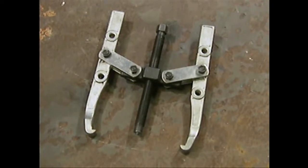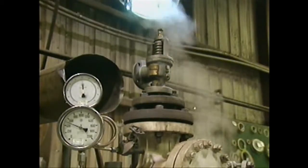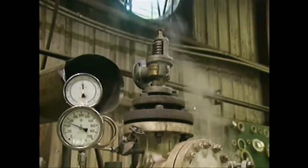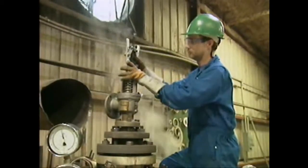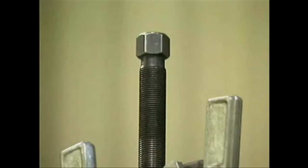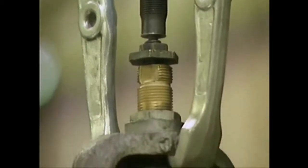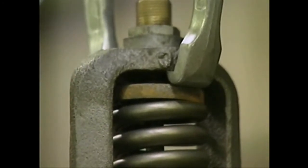Gagging involves installing a device called a gag that keeps the safety valve from opening during testing. For a two-ring huddling chamber safety valve, with the release lever and protective cap removed so the top of the valve stem is exposed, align the stem of the gag properly with the valve stem. Then attach the jaws of the gag firmly to the yoke to prevent the gag from slipping. Finally, tighten the gag finger-tight only — never use a wrench on a gag. Gagging a valve improperly can be disastrous, as damaged valve parts or serious injuries can result if a gag slips and the valve opens unexpectedly.